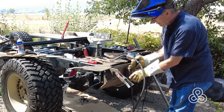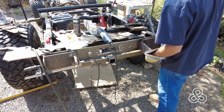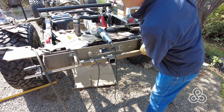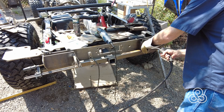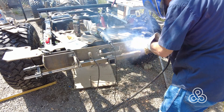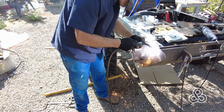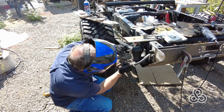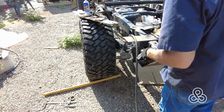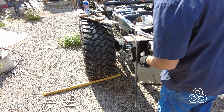There are also a couple of very heavy duty anchor points that are going to flank each side of the receiver, made out of half-inch steel plate. They go through a couple of slots and will be welded to both sides of the parallel quarter-inch plates. This parallel plate system is going to make for a tremendous amount of strength. There will also be one last piece that will go across the top that all of this will be welded to as well, making it a complete box section. This thing's been held in place by a couple of bolts through the chassis on these corners, and I'm now taking those bolts out, reversing them, flipping around, putting the nut on the outside, and then welding that nut in place so I can have a captured nut system.